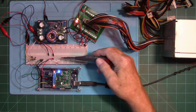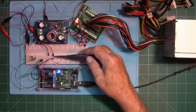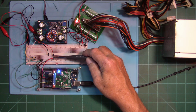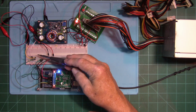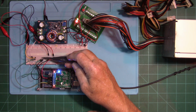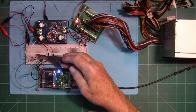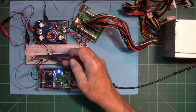In this demonstration, I'm using a breakout board just to make it a little bit easier to check the voltage on the output of the booster. So I could put my probes over here. And then when I have the track hooked up, I could hook it up to the program track on these two right here, and on the op track on these two terminals right here.